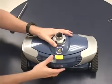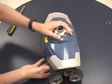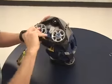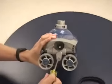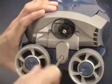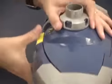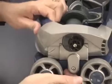Now I'm going to take you through how to change the direction control device on an MX-8. The first step is to remove the track off of the side that you want to replace. Next, remove this one screw that holds the side body panel onto the unit. It helps if you open the lid of the MX-8 to create clearance, and then by lifting with your finger underneath this tab, this assembly will come off.